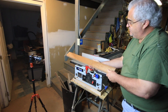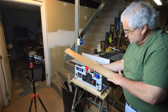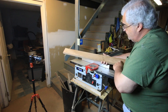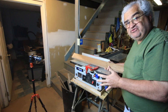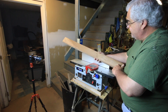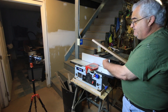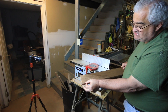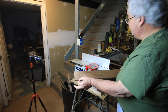For that first cut — it's shining here and here because we got full contact at both ends, but we didn't get anything cut in the middle. You could probably hear the change in pitch where it wasn't cutting in the middle. We removed some material at each end and you can see a ridge right here. My fence is actually too far back, so this little quarter inch was not on the table where the blade was. I need to adjust the fence a little bit so we don't have that problem.